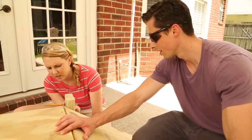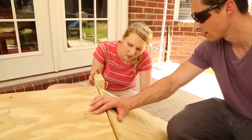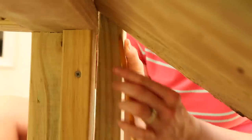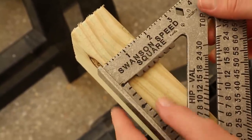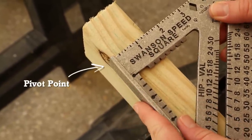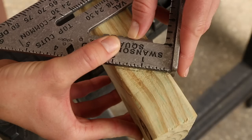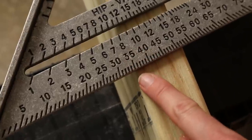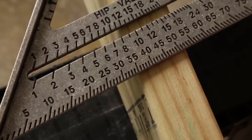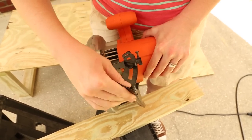Since we have the ramp in place, I'm getting a mark of what the angle is so we can put a 2x4 underneath for support — that lawn mower can get pretty heavy. To find the angle, line the pivot point of a speed square at the point where the edge of the board and pencil mark meet, then turn the square until it lines up with the mark. Follow that down to where the angle notations meet the board and you've got your angle — in this case, 35 degrees. After unplugging our saw, we set the blade to match the 35-degree angle.